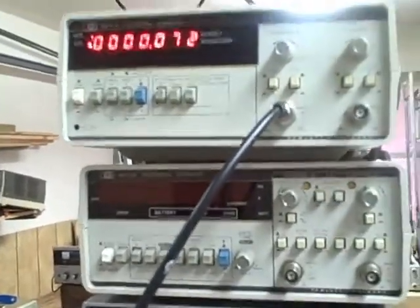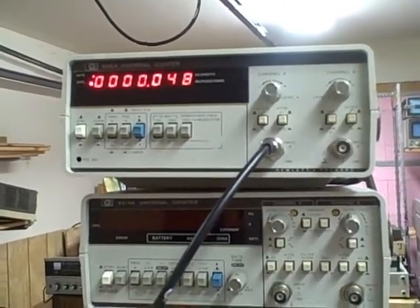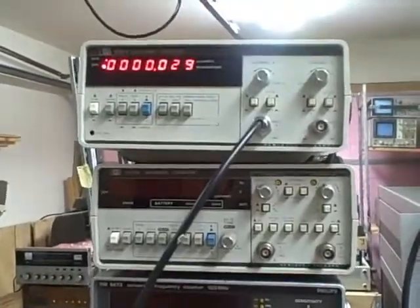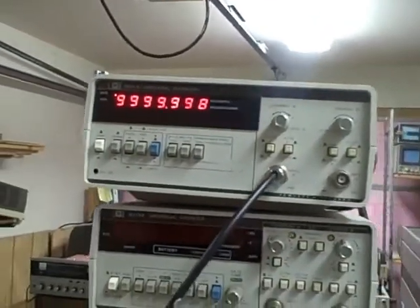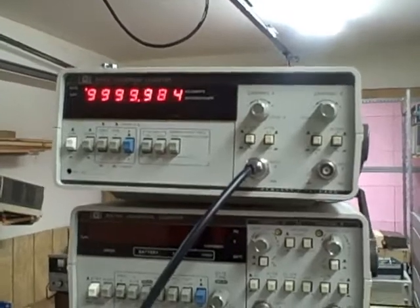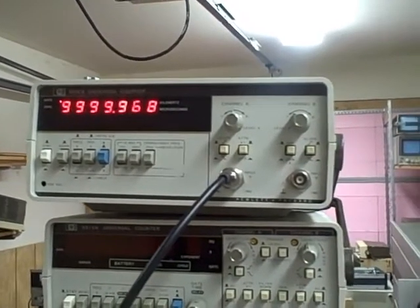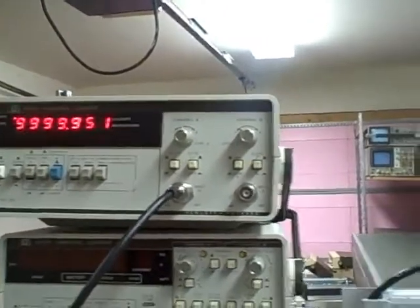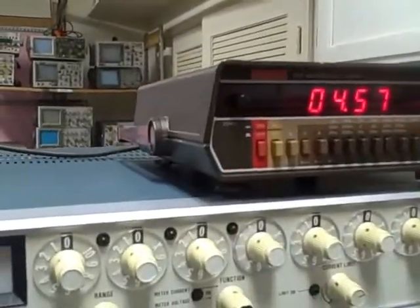So we should be good to the 100 millionth place, not just the 10 — 1 in 10 million — we'll be good one more decimal place. So we just have to wait. Right now she is on its way down in the sweep; we just swept from 10 MHz on the counter towards the less than 10 MHz side. We are still in unlocked state.